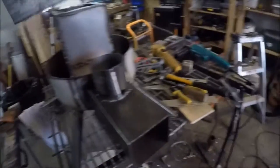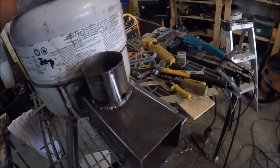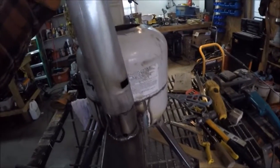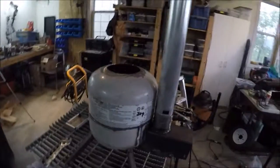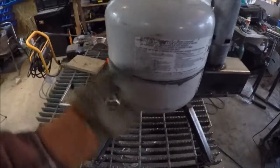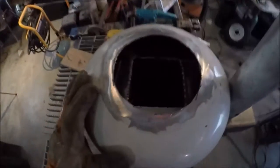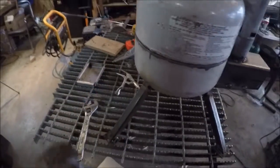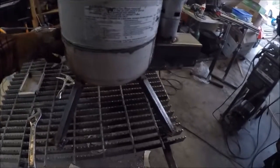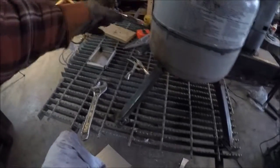So I was just showing the wife the final assembled product, just like so — super miniature — and in the feed tube like so. As you can see, it's coming together nicely. What we're missing yet is the exhaust off the back here. So what I'm going to do is tack the tank back on — that's all sitting nice and centered. I'm going to tack the tank back together and then work on the exhaust. I'm going to build it out of some 1/8 plate, build a little chamber big enough to support the opening on that tube, and then that tube can just sit on there and goes up to the top of the tent.